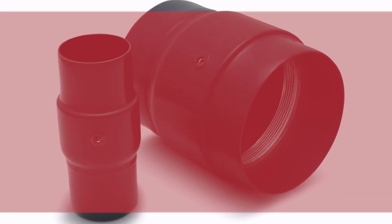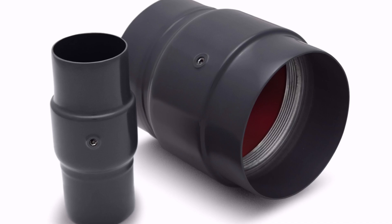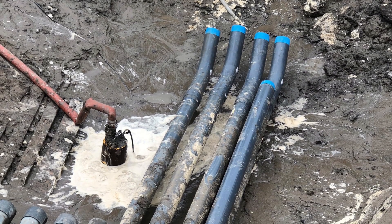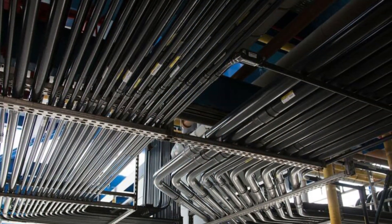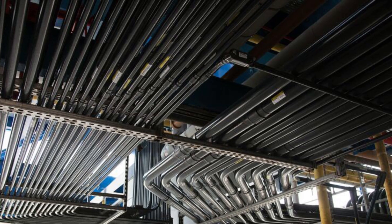The PVC-coated speed couple is used to quickly and easily install PVC-coated rigid conduit and elbows. It is rated for direct burial and ideal for tight space applications. The PVC-coated speed couple allows you to complete connections without having to turn the conduit or elbow.